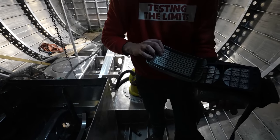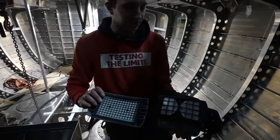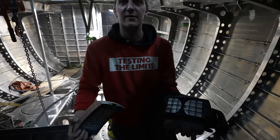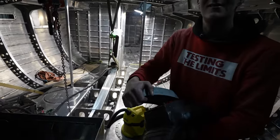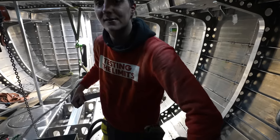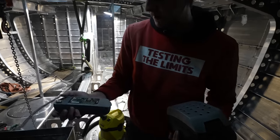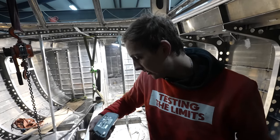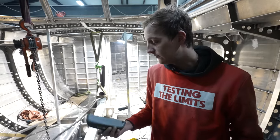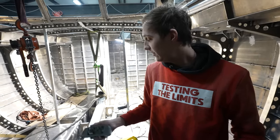That's a charcoal filter - charcoal, dust, and particles. When you're working and welding, you breathe through the charcoal and get clean air inside. Your face is close to the work, but your air is coming from behind you. It runs off lithium batteries - two of them - and they almost last eight hours, so that's a full day. You only need a couple of them.